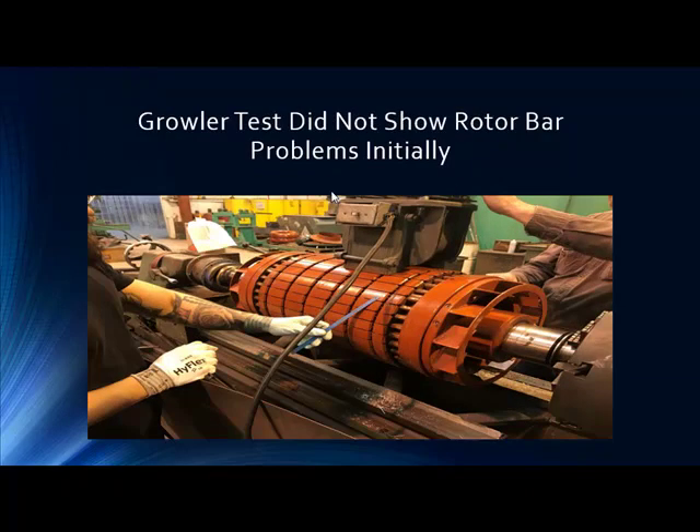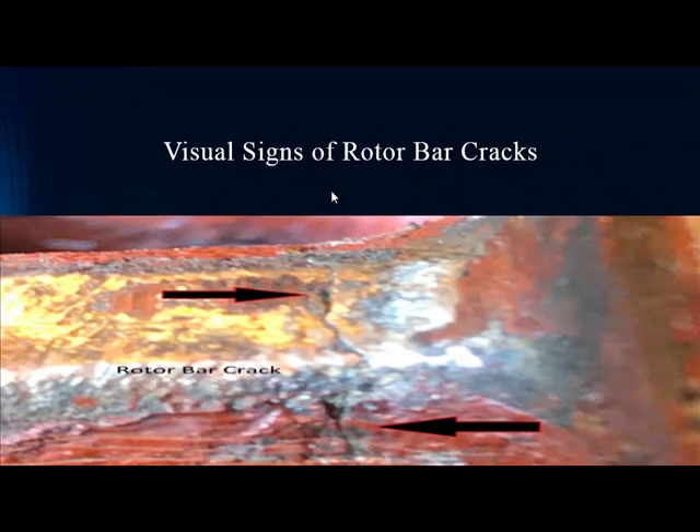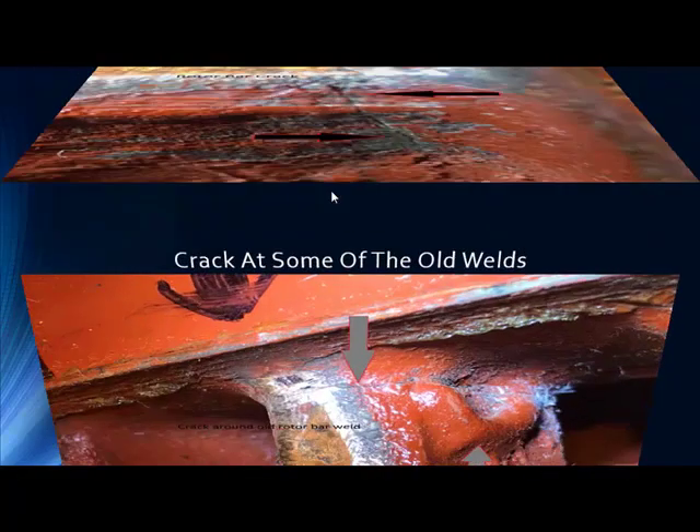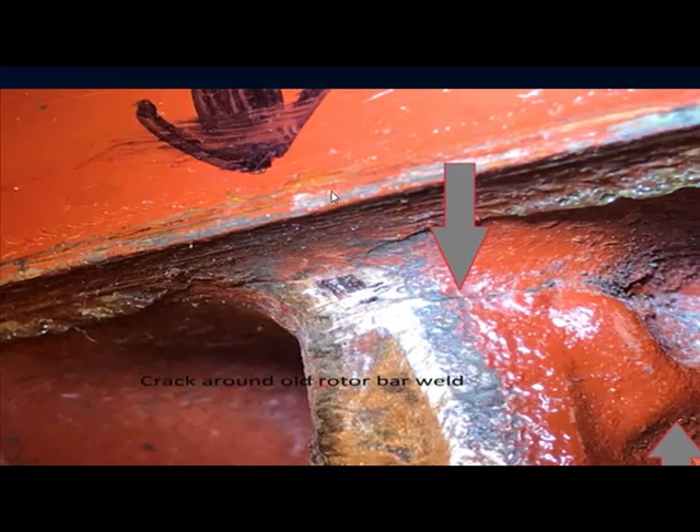So we take it to the shop — they pull the motor, and the growler didn't show anything. We've been hearing this a lot from our service industry partners: depending on the expansion and contraction of the rotor bars, when it's cooled down like in this state, it's possible that the rotor appears healed and the growler may actually miss it. So it's never a guarantee, but it's a good shop test. The analysts felt confident that there was an issue, so they asked them to just scrape away some of the paint and insulation on those rotor bars. And this is what they came up with — it's pretty evident that there's a little hairline crack that went through the rotor bar. This is a great catch, early on in the development of the fault, rather than waiting until the bar is trying to fly out of the slot. When this thing's up and running, that separation around the crack may be a lot bigger than it appears now — when it's cooled off, contraction is pulling it together, so it doesn't look that bad.